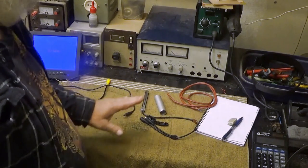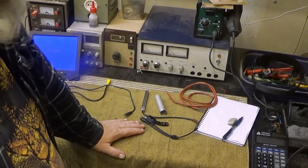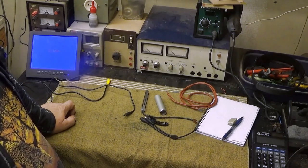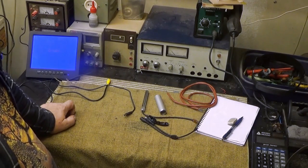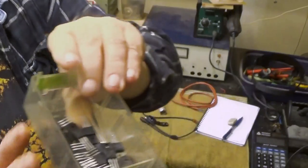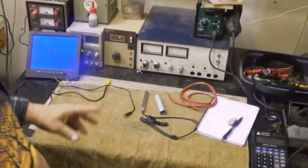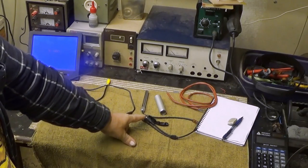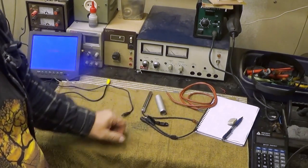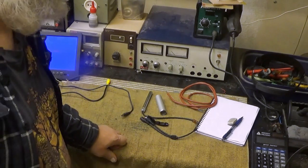There are some things here. First of all, the microscope is working on 5 volts. Okay, not a problem. The display is working on 12 volts. Not the same voltage. A little bit of a challenge there. We can use one of these guys. These are 5 volt regulators. I also need to find out how much current this thing draws, because I noticed that it's getting a little bit warm when used for a longer time, so it might consume some power.